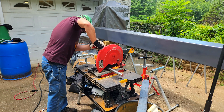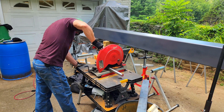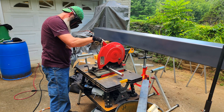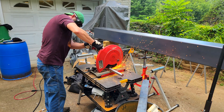Right here, I'm attempting to cut this 4140 round bar that's going to be used as a hydraulic pivot point. I was partway through, and I think I wasn't putting enough pressure, and I think the steel work hardened on me. So I rotated it right there, and now it's starting to cut.